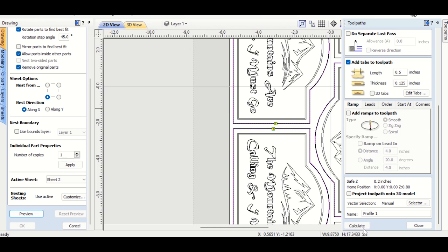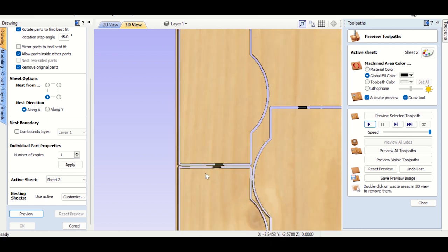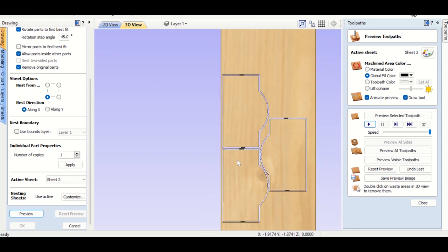Taking a look at just three of these, you can get a feel for how it's going to cut out. Basically this tab is in a meaningless position — that's something to consider. Maybe reorient where you place your tabs and specify that. But you can maximize your material with nesting mode. There are videos with a more in-depth look at the nesting feature if you need it.